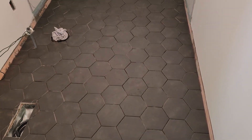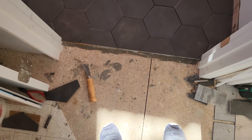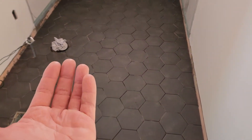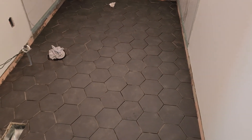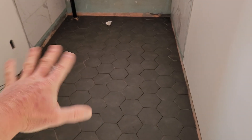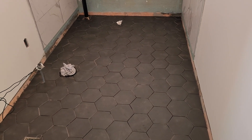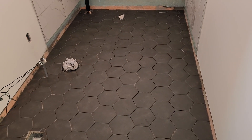Here's another tip — because this is a floor, it's a lot different from walls. I don't want to drag in construction dust and debris. So I need to shop-vac this entry area and I'm going to step onto the tile in just my socks, because I don't want to contaminate my grout. I'll work from that end pulling back this way. Going over everything again gets rid of thin-set accumulated in the edges, and I also spotted a couple grout lines where thin-set was a little thick — we want really clean, clear grout lines free of thin-set so we can get good grout established.